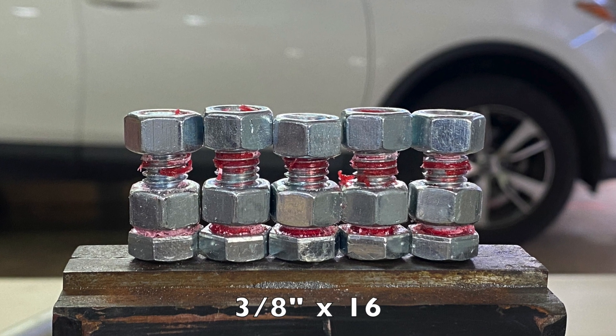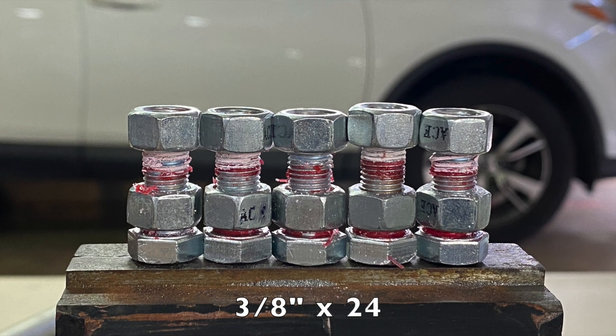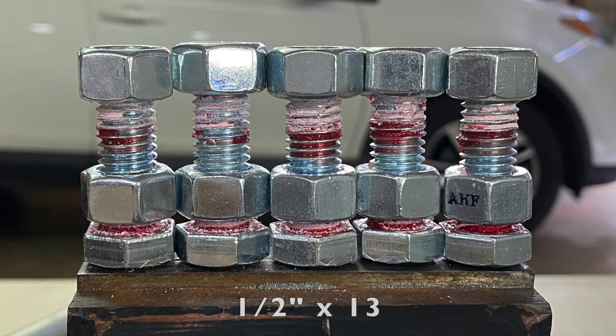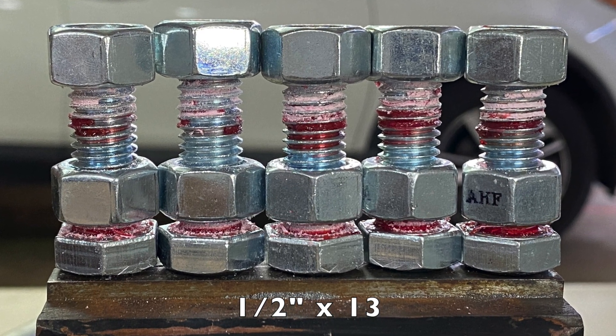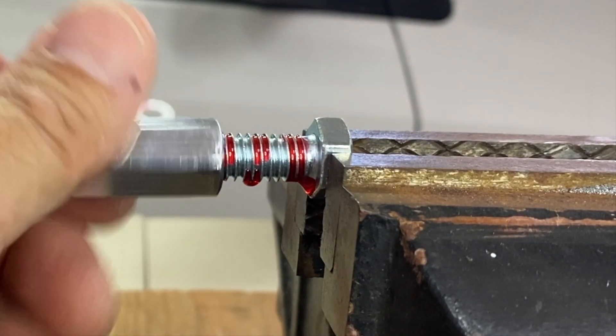So, compared to the 3/8x16 nuts and bolts torque averages: the 3/8x24 breakaway and prevailing torques with more threads per inch were consistently lower; the 1/2x13 breakaway and prevailing torques with more surface area and thread locker were consistently over 1.5x greater; and the 3/8x16 coupling nut loaded torques, also with more surface area and thread locker, were consistently over 1.5x greater too. On to the next video.